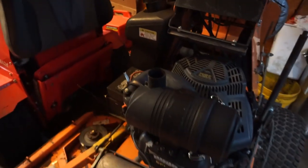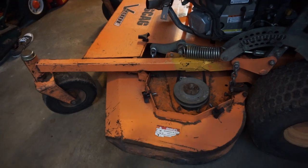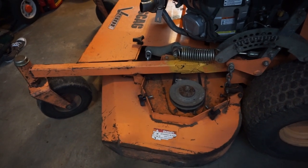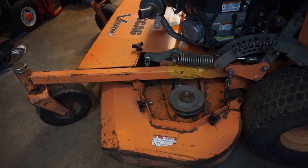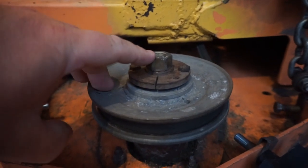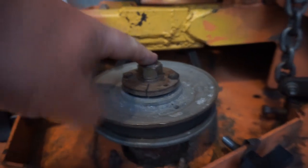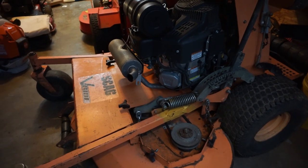That'll be all done and ready to go - like I said, small cosmetic things, but also you don't want water getting into a lot of that stuff. As far as the spindles, when I was changing the blades the other day I noticed a couple of them were bent. One's way more bent than the others as far as the bolt that goes up through the blades and holds on to the nut. This bolt through here is bent, so I'm going to buy new bolts and probably new spacers too, just to see if that helps the problem. That way I'll know whether the spindles are bent or not.